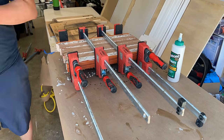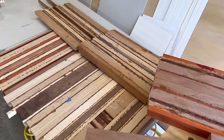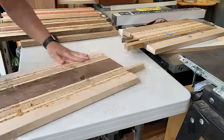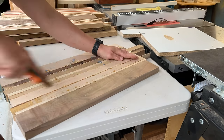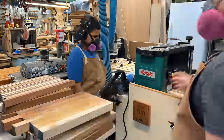Here are some boards after they've been glued up with all those glue dots. I prefer not to wipe off the glue ahead of time — I let it form dots and then scrape them off after the fact. I let the board sit for about 8 to 12 hours, usually overnight, and then scrape them off the next day.